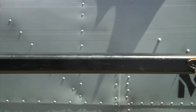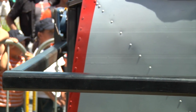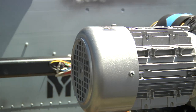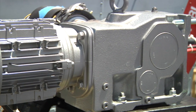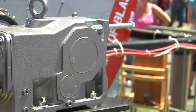Around it we have what we call the pitch frame. The roll frame spins inside the pitch frame, and the pitch frame spins inside the A-frame, which is what's on the ground. We're doing that through two one-horsepower motors — these are 1,750 RPM each — and we have a 100-to-1 gearbox right on the end of that. So we get about 17.5 RPMs, which is about one revolution every three seconds, and it feels pretty fast when you're in there.